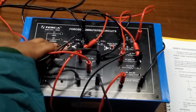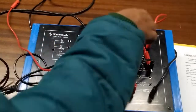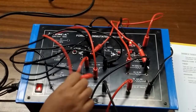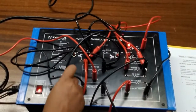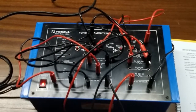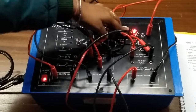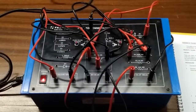Turn on the kit and press the trigger pulse to turn on the SCR. As we press this switch we can see the SCR is turned on and the LED is also turned on. To turn off this SCR we need to give an external pulse. The base terminal will be connected with the positive terminal of the oscillator and the other terminal with the negative terminal. As we give the external pulse we can see the LED is blinking. The turn-off time is equal to the width of the applied pulse, so the SCR turns on and off repeatedly as we are giving an external pulse to the circuit.